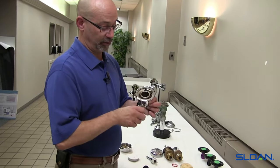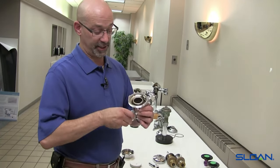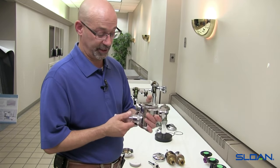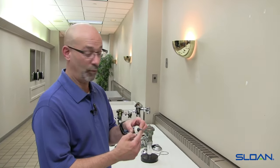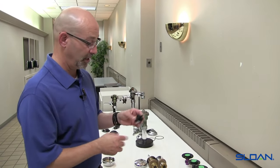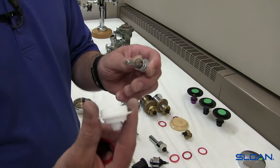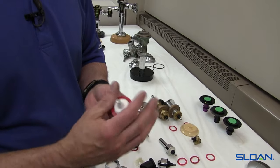The handle is a very important part and it does wear out — two forms of wearing out. One is leaking, and there are two places it's going to leak. If it begins to leak from the coupling, that tells you the gasket may not have been squeezed enough and is not providing a seal. If it leaks from the knuckle, the seal inside the handle assembly has worn out and water is beginning to pass by the plunger assembly. You may also find a push button on the front of your valve that also has a seal. We have two different types — the B50A, which has been around over 50 years. The B50A has a white bushing, a plunger and spring, a cone seal that snaps over the barb, and a gasket for the side of the valve body.